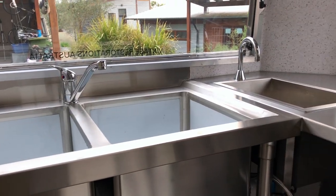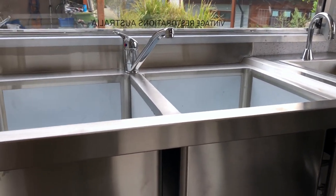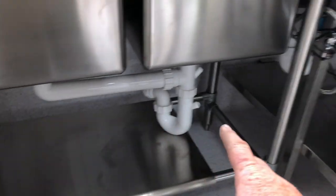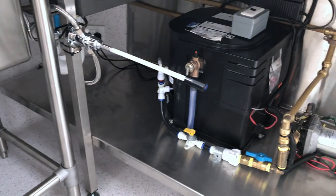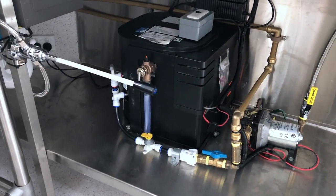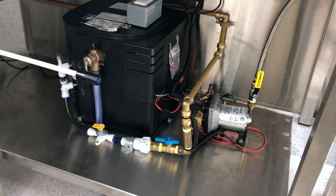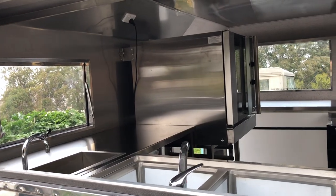The plumbing is pretty straightforward. You've got the hand wash sink there, a mixer tap, and the hand wash is knee-operated for ease of use. Got the waste water going there, coming down from the hand sink. An LPG or propane gas hot water system — it's like a 14-litre storage system, so you've always got 14 litres. And we've got a Shurflo 12-volt pump.